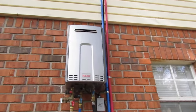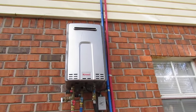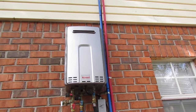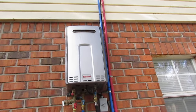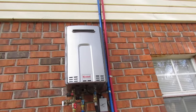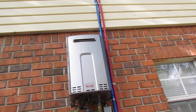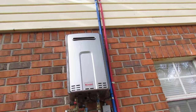You can run this red and blue, like you see there, to let you know which side is hot and which side is cold. But it's pretty much the same material for both. One thing about PEX is that even though it's resistant to freezing, it can still freeze and it can still bust. It should also be insulated if it's outside, because it's really vulnerable to UV light — even ambient UV light can degrade this product.